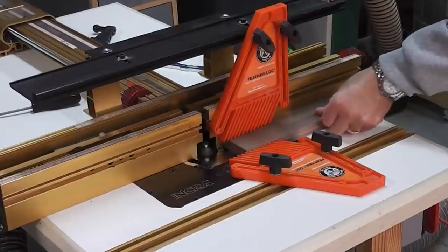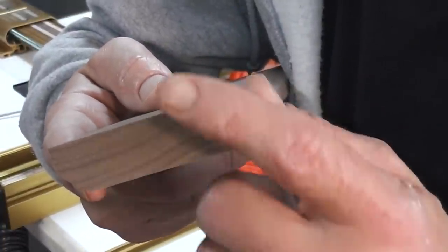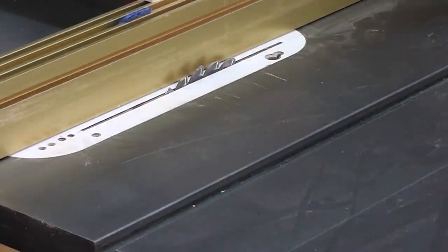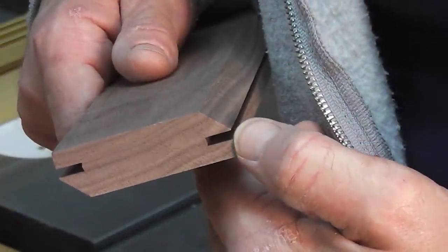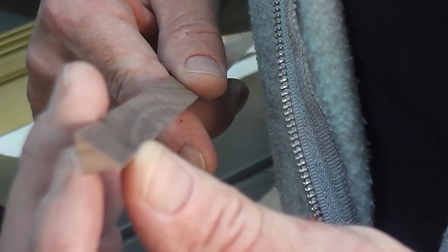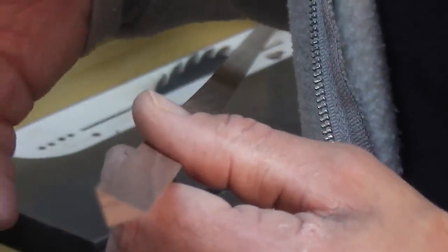As you can see, I've got these 45-degree chamfers cut. I'm going over to the table saw to cut them off. I've got my table saw height set at three-eighths of an inch and I'm a quarter of an inch away from the fence. First I'm going to make a pass on the edge to help separate that piece. Now that I have those grooves cut to help separate the pieces, I'm going to make another cut all the way along — three-eighths inch from this edge. This is what I'm looking for: a nice three-eighths by three-eighths inch piece with a 45-degree chamfer. I just need to go back to the router table and do this all over again to get four pieces.